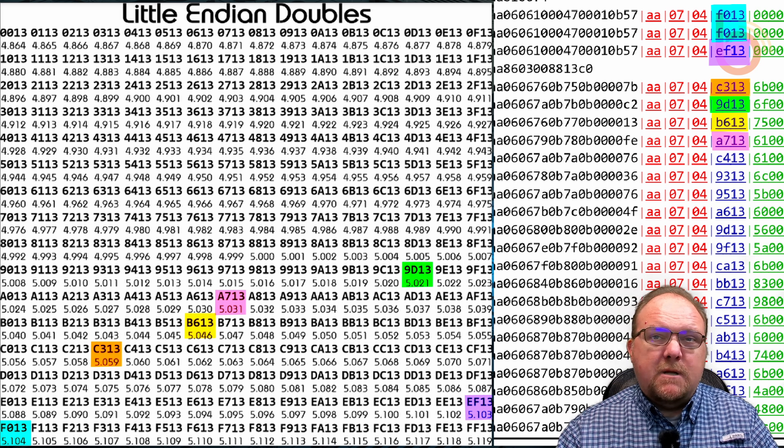And those bytes belong to data type 7. For example, the hex value 0x8813, when converted to decimal, becomes 5000. Now, if you apply appropriate scaling — divide by 1000 — you get 5.000 volts. That's perfect. That's exactly the range of the USB V-Bus.